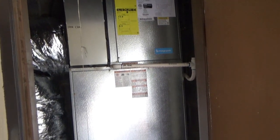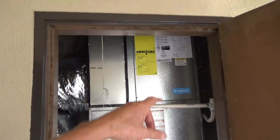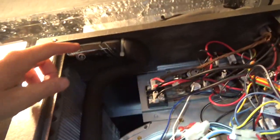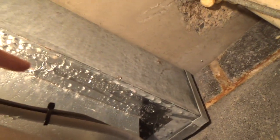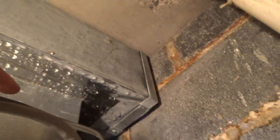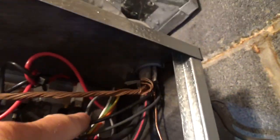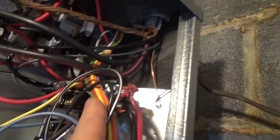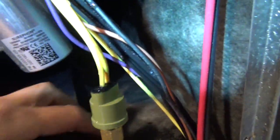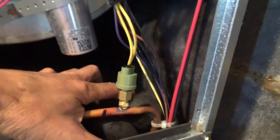In this video I want to show what's happening — the board's getting water on it. At first I thought the sweating was here getting the board wet, but it's pretty clear that the water is coming from the wet ductwork, pooling on top, and then following these wires down. We get water dripping on the board right here, and you can see a huge pool right there.